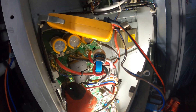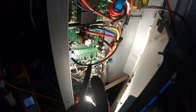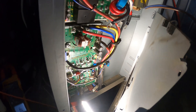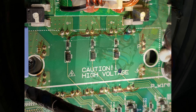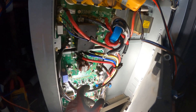We've got a bad inverter board. You can see all around here there are dark markings that could be from overheating. Right behind here is the heat sink, so this could have easily overheated. You want to have solid connections — nothing loose. They also want to make sure you've got no loose connections.